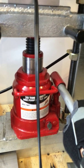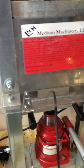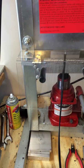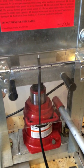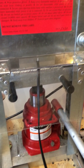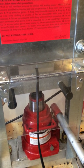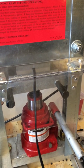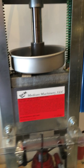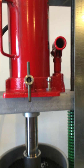This is part of the fact that the 20-ton jack is pretty strong, so I don't have to crank on this very hard — I just kind of set it. Then we'll lower the shield here. I've never really had anything pop out of there if there's a mold involved. But if you push plastic out and there's no mold there, sometimes the pressure release from inside the chamber will cause the plastic to actually pop. So that's a time where you want to be pretty careful.